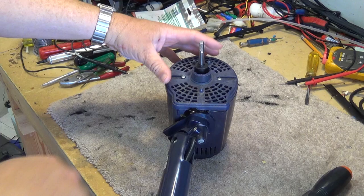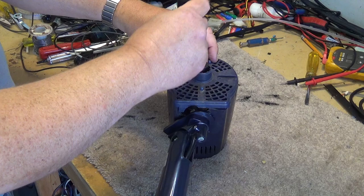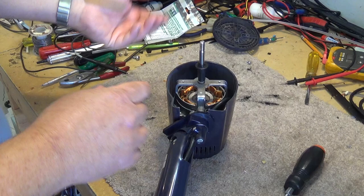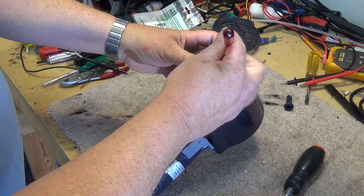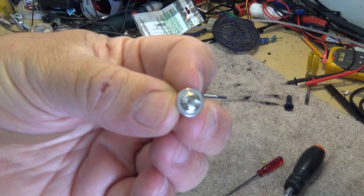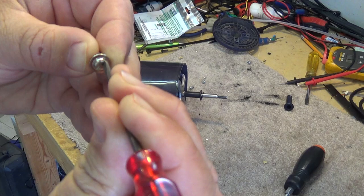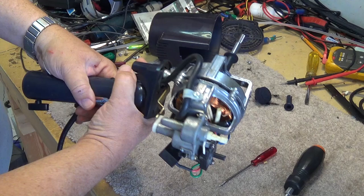The first thing you've got to do is take the fan apart. On the front of the fan, after you've removed the blade itself, you can open up the motor — a couple of screws hold the front of the motor on. That gives you access to the front bearing, but we need access to the back bearing as well. To do that we remove a cap on the back and one more screw underneath. It's a special screw but you can generally open it with a small slotted screwdriver. Now pull the knob off the top, and the back half of the motor should just lift apart.